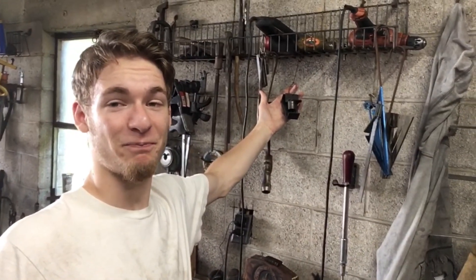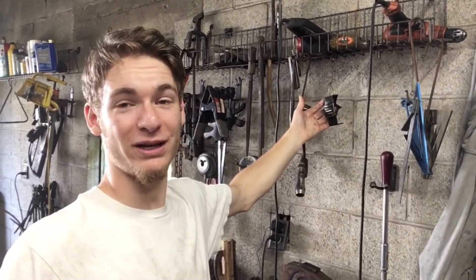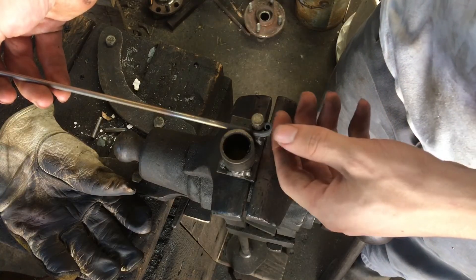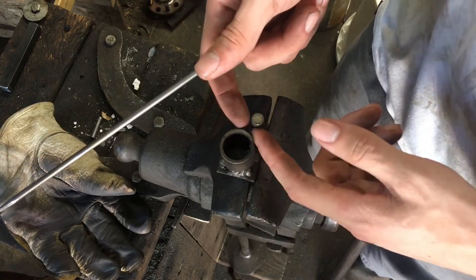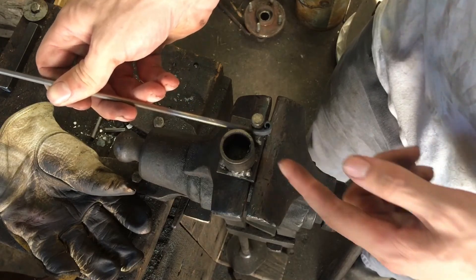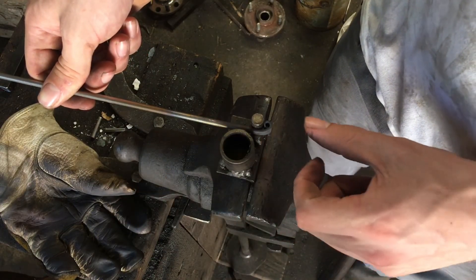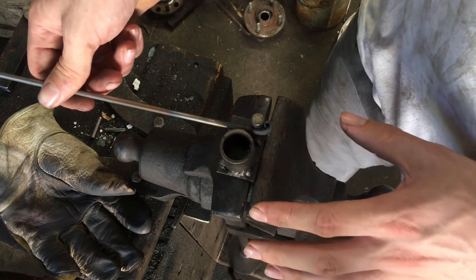So now with our little scrolls done, we get to move on to a couple jigged portions, which I tied and marked according to their identification in my instructions so that they don't go anywhere. I know exactly which ones they are because I make a lot of jigs, and if I didn't have a way of keeping track of them, that would be a problem very quickly. So basically we have our pipe that's the size of the inside diameter of our hoop on the end, and then we have this stop and we can use that to orient it properly with the scroll. We have that bit of a flat area we can register against there. I'm going to wrap it around and then bring that in a little tighter once the rest of it's around.